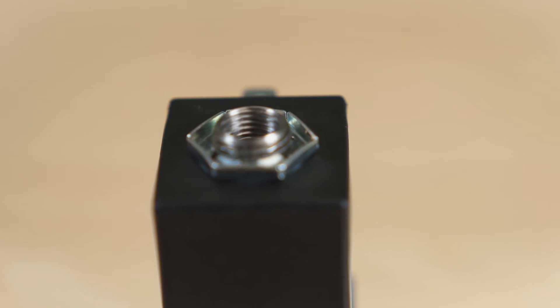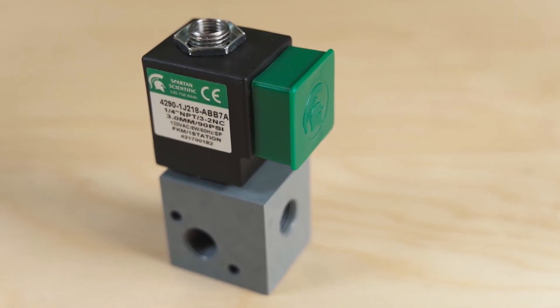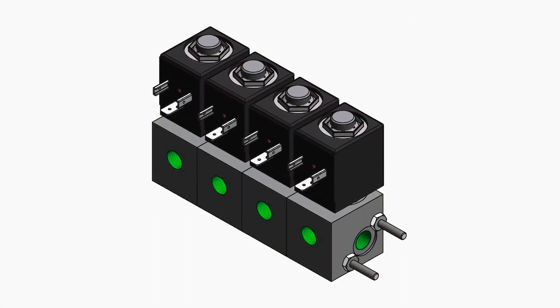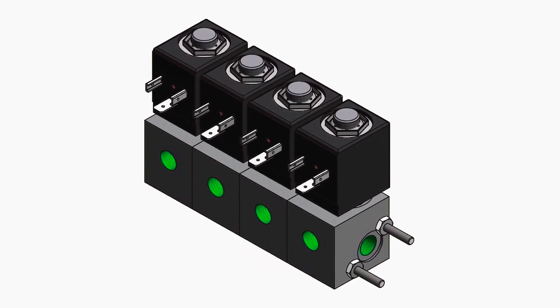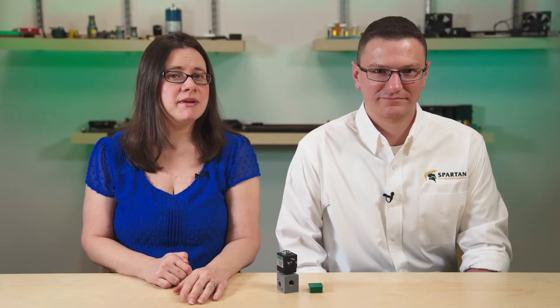So are they available as single units or as stacks? Both, actually. Instead of having to machine and inventory multiple sized manifolds, companies now have the flexibility of buying the Series 4290 in single units and building whatever size manifold they need. Each individual valve is interchangeable. It's a fairly compact design.